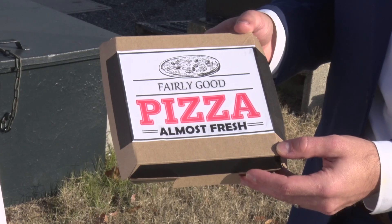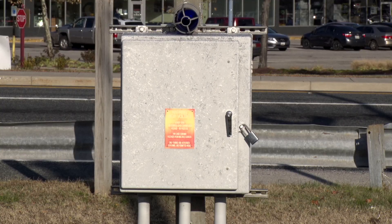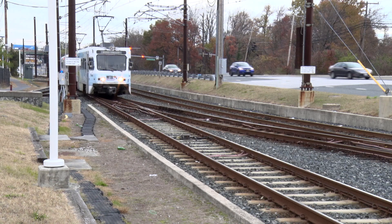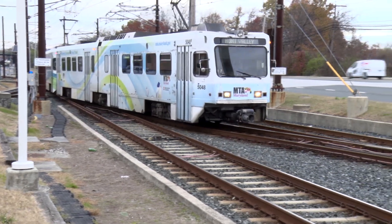Administrator, I've asked Systems Engineer David Wilson to join us here today. Excellent. I've been doing railroad engineering for about 27 years. This track switch here allows access to our passenger stations from our main lines 1 and 2. Administrator, observe the switch machine is currently set for a diverting route. Note that the open gap is at the diverting rail. Now observe that the train is making a trailing move over the switch into the passenger station.